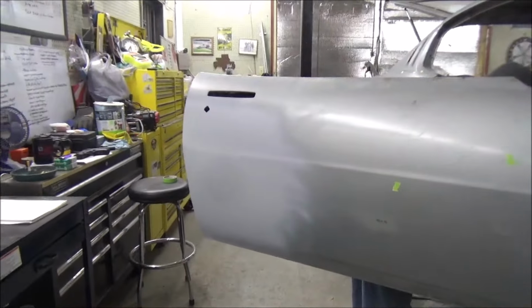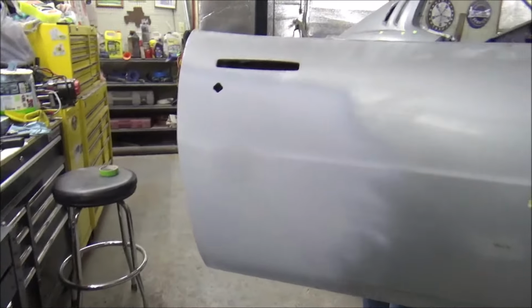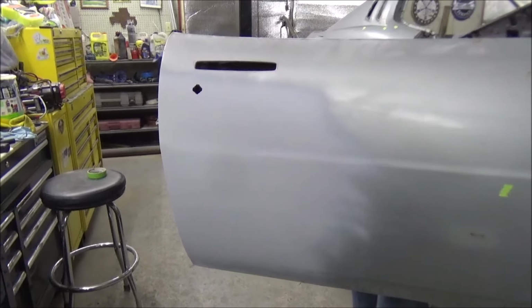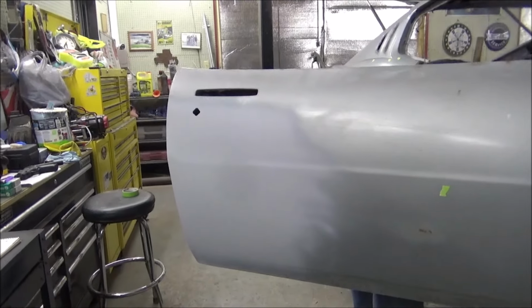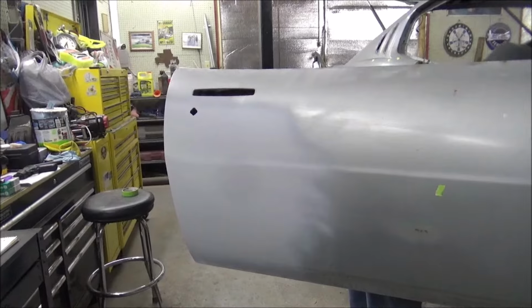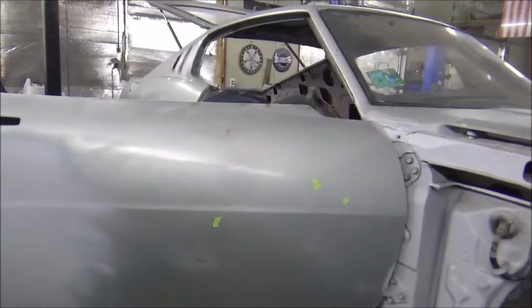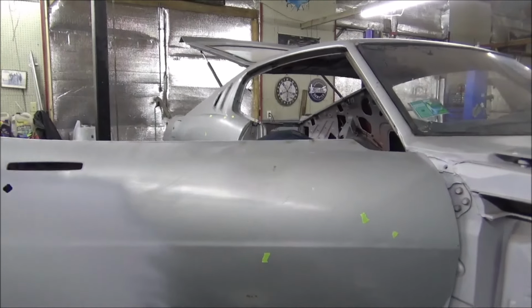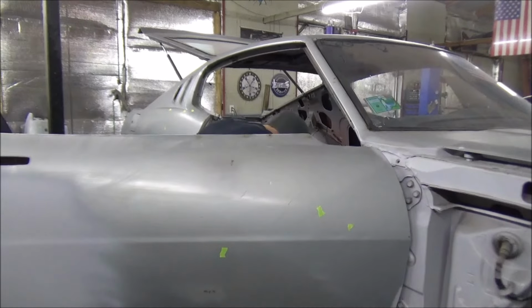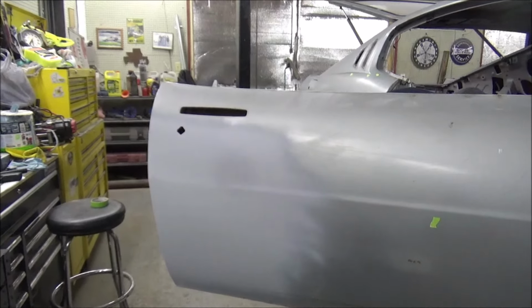Oh, and I almost forgot. We got that bodywork done on the door and primed it out. That turned out really slick. Now, whoever paints this, be it me or somebody else, they'll sand down that spray can primer and shoot some real high build primer out of a gun over it and block it. Then it'd be 150% perfect. And it did get that piece up there on the hatch as well. All these little dots, when I contact the customer, they're all little dents or dings. We'll see if he wants us to fix them or if he does not want to nitpick that much. But we got the big part done and it turned out great.